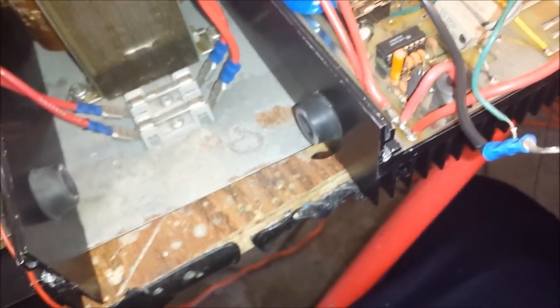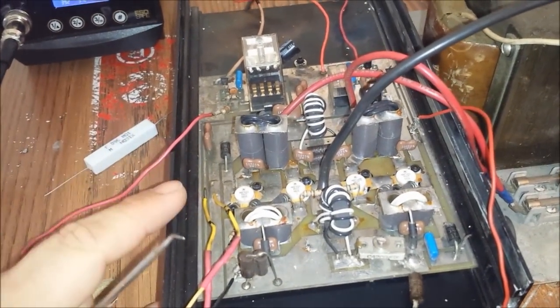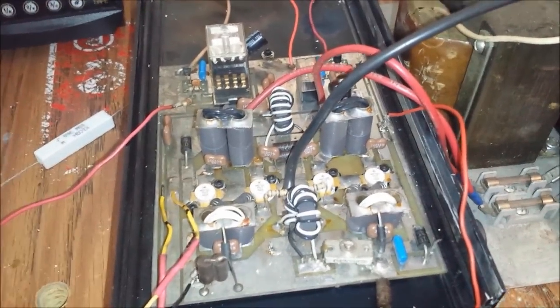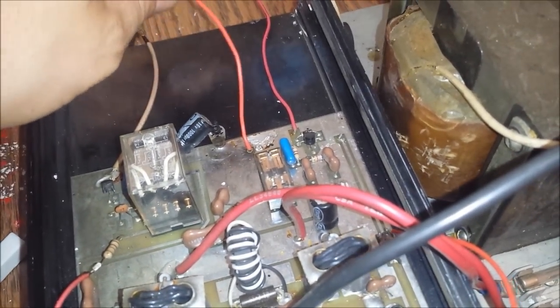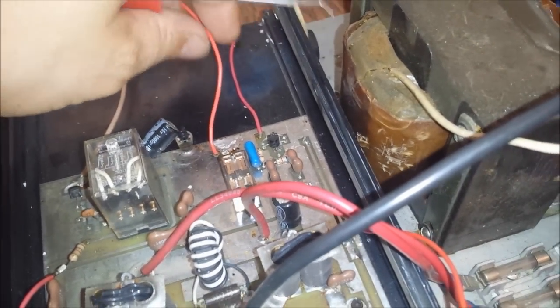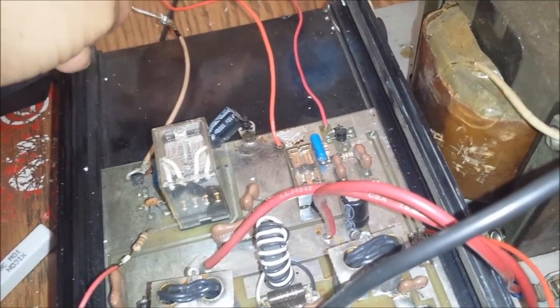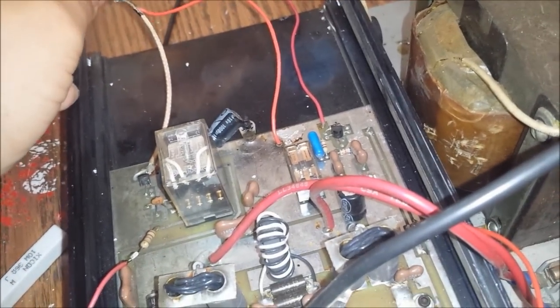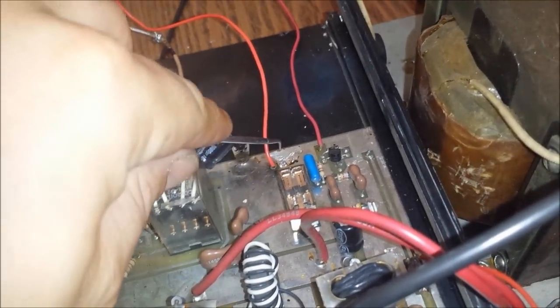And then what we're going to do, instead of going to the trouble of hooking this thing back up, you know, putting it all back together, I'm going to test these sections individually. Meaning I'm going to hook an external power supply to this section first. Make sure this is going good. Another thing I noticed, this wire looks very loose. This is your output coax feeding to the SO239 on the output. I mean, these wires will get moved around and just break off, you know. And a lot of times if you have Teflon, they won't break off as easy. But I'm going to take this off probably and throw an RG316 jumper like it's on this one. Okay. Because you can tell that's what's supposed to be there, because this is where the ground of it was soldered originally, right here.